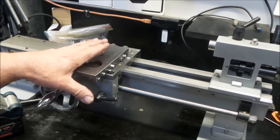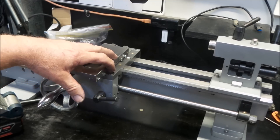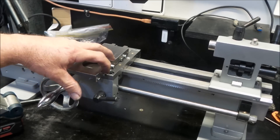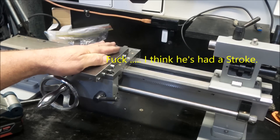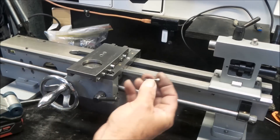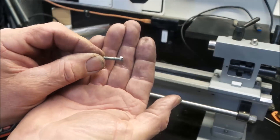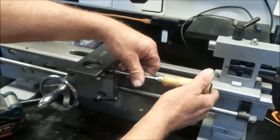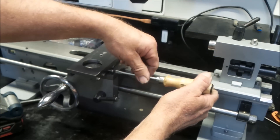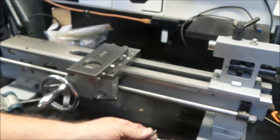I've added a whole heap more screws along here — something I saw on a Steve Jordan video, not my idea but something I absolutely approve of. At the same time I'm adding locking screws that aren't set with a lock nut to adjust the gib, but are purely there just to lock the cross slide in position. The screws I dug out of the drawer are too long for the purpose, so I'll show you my technique for shortening them and putting a blunt point on them.